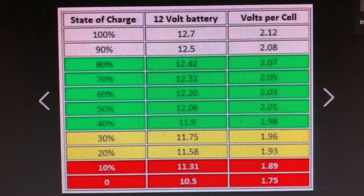If you know your battery is pretty good, you can tell whether it's been charging up from a solar panel. If it hasn't been used for a few days, just put the multimeter on it and you can find out quickly and easily. I do this all the time in the boat, especially with the solar panel, to see if it's been charging up and whether I need to take the battery home or leave it on the solar panel.